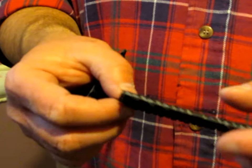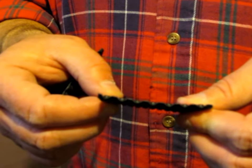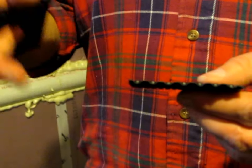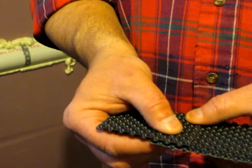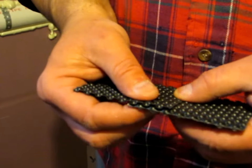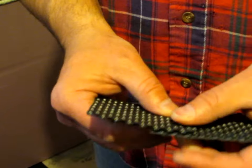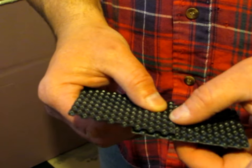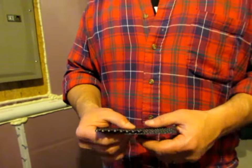What I like about it is it's a really thin membrane — it's only about an eighth of an inch thick. So this is the pieces of the SuperSeal dimple mat, and it's really only about an eighth of an inch thick overall. It gives you a very nice low profile, especially when using it on the floor — you're not going to lose a whole lot of headroom when building it up, especially when I want to add some insulation and a subfloor on top of it. The dimple mat I'm going to overlap at each seam. I'm using a GE2 silicone caulk in between to give myself a little bit of sealant at those seams. They fit together pretty nicely, and then I'm using a Gorilla brand adhesive tape to tape the seams to hold these dimple mats in place on the floor while I'm adding the next level of insulation and ultimately the subfloor to the top of it.